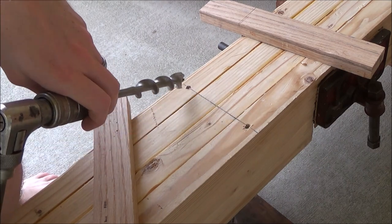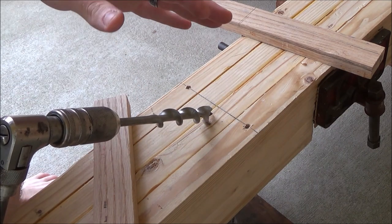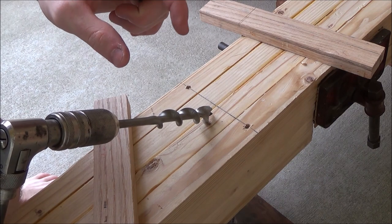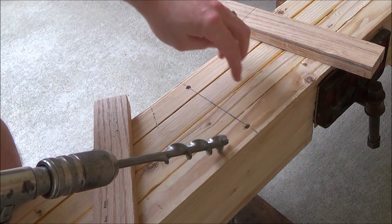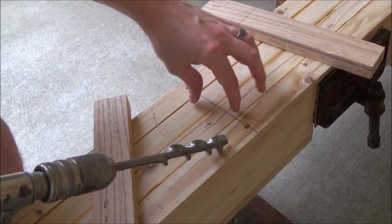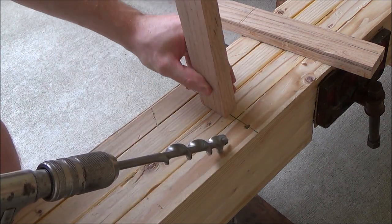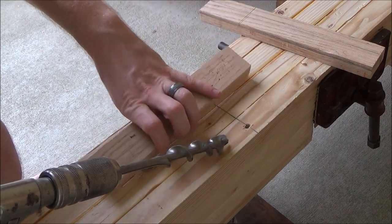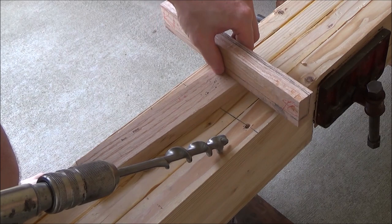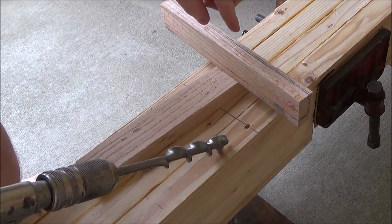You can kind of see I experimented with some threaded inserts — those little threaded things you push into wood. Anyway, it didn't really work out so we're going to do something a little bit more drastic. I'm going to mortise out a little piece, and then take this other piece of red oak and mortise it on that. We'll have like a T-bar stop sort of thing.